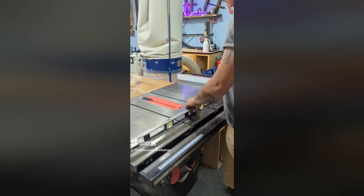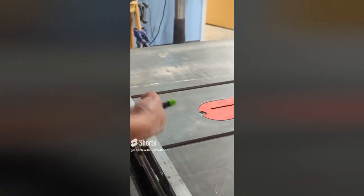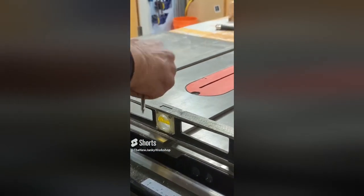I'm out here at the table saw. I'm going to put this level down and mark it so that one end is right at the edge of the table saw so I'll remember where I was. Checking the level — the table saw is not perfectly level. It is tipped a little bit that way, so the bubble is a little closer to the line on this side and reasonably centered on that one. This one has two levels to kind of give you better accuracy. Now I'm going to flip this thing over end for end, put it in the same spot, and check level again. This bubble is again just a little touching on one side, but this bubble's in the center, so we know this one is the better, more accurate one. The Essential Craftsman — I learned it from him, so he's done it better than I have. Go watch his channel.